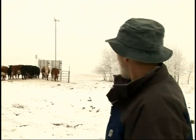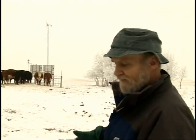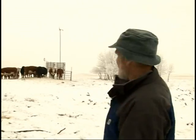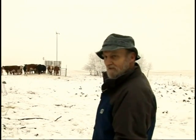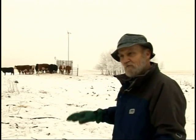You have to trench in from the casing there — that's a 36-inch casing. You have to dig in a line from the pond, the dugout, down as steep as your dugout is. It's probably 14 feet in the ground, and we attach it to the culvert. Then you're set for life because you'll always have water that's going to be open.